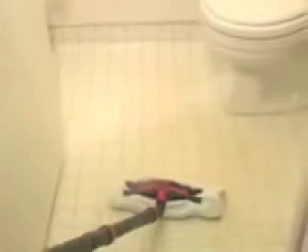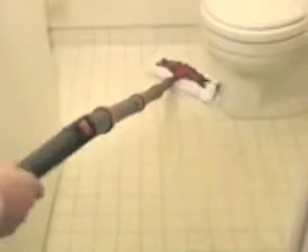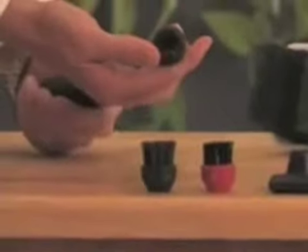The next time you clean this tile, you'll likely be able to use the one-step process with the towel wrapped around the rectangle brush. The stainless steel brush is really fast, but please be aware of how much pressure you're using — you'll dig the grout right out if you push too hard.